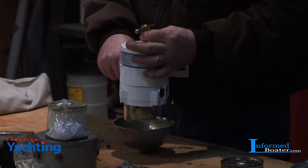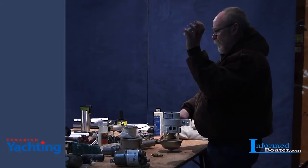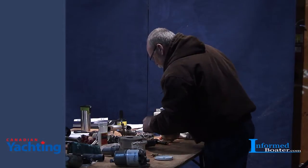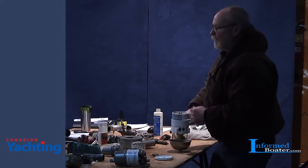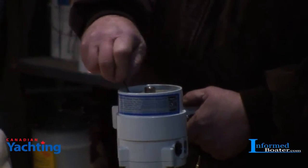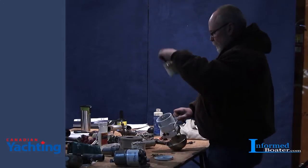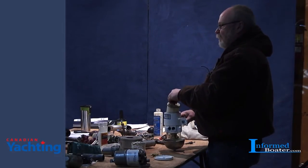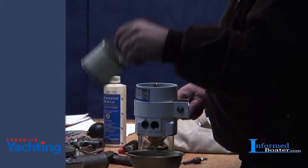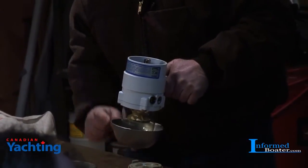No tools needed. Drain some fuel off the bottom to get the impurities out. It's got an O-ring where you can deal with it - new O-rings come in the package. To open the drain, you just need something small to flip up the little handle so you can get your finger on it. The handles seal to the stem - you lift it up and let it dribble. With your plastic gloves on and a Ziploc bag handy, when it's done dribbling, in the bag it goes and off the boat it goes. The fuel stays in the filter instead of having a whole bucket to dispose of.